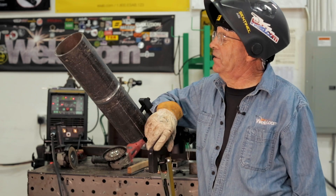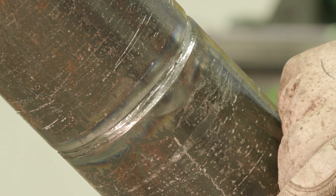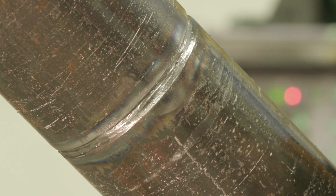Cubs thinks that I can't do this. Got to do a little filling cap here in one pass. Four inch, schedule 40, gas metal arc welding or MIG, .035 wire.